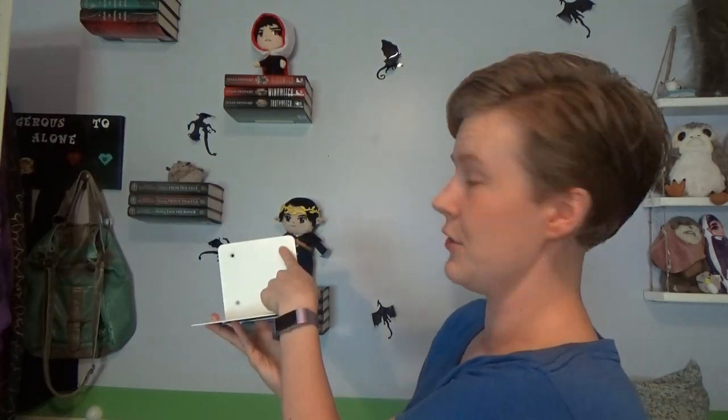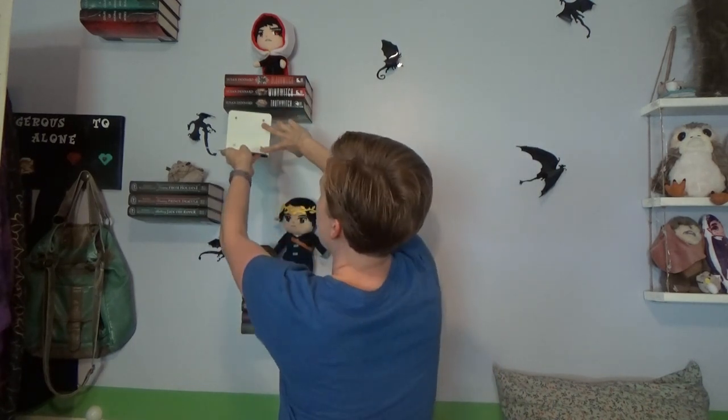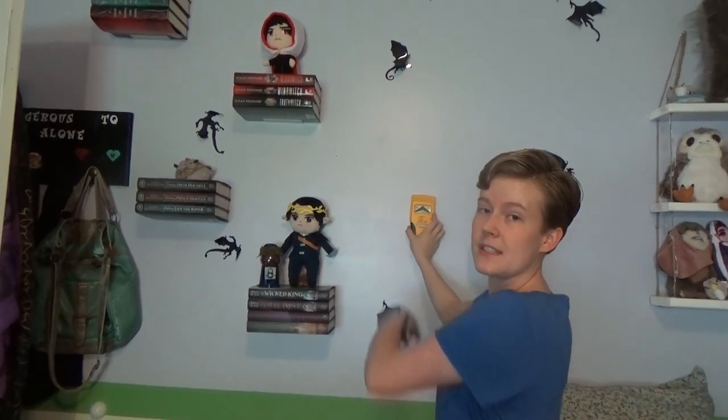These shelves are too wide to get all four nails into a single stud, so what I did was two on each shelf — two into a stud and two with wall anchors. If you want to go into a stud, you need this handy thing called a stud finder. Where it beeps, it found a stud. My tripod is sitting on a table and the cat just jumped on it — hopefully she doesn't knock it over. So that's the basics of finding your studs.